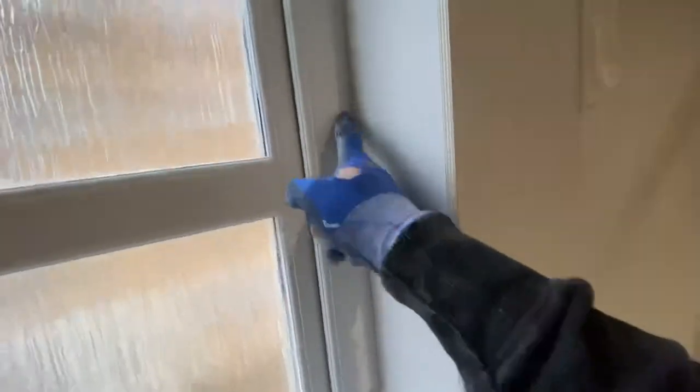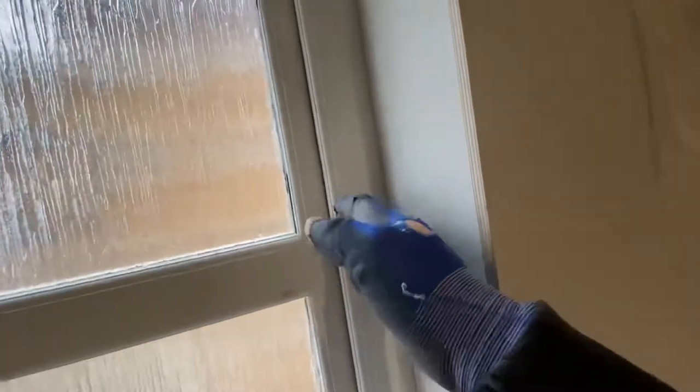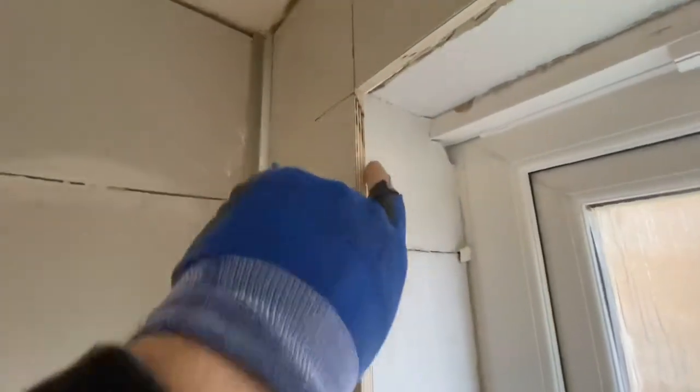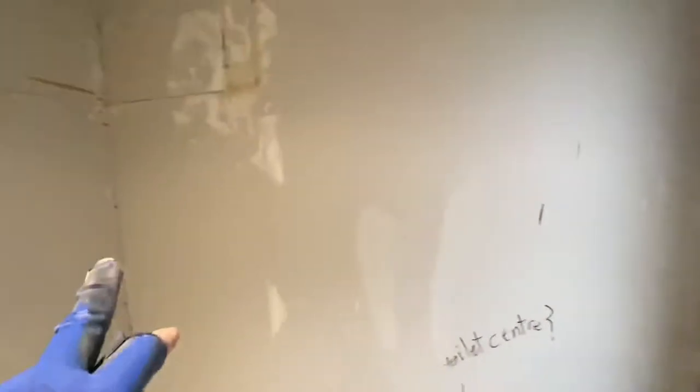They're quite big old frames, these, and they've got a few scratches on it, so I wanted to make sure my panel kind of hides them scratches. Same round there. They need slightly altering, just cut them back a little bit to get them level, but these are all good. These little bits up here I'm gonna have to cut off. That's just where I sawed it before I put the reveals on. But yeah, I'm gonna leave that like that for now. Panel this bit here, and then I'm going to jump back on this bit, show you how we do the reveals.